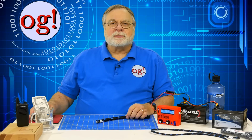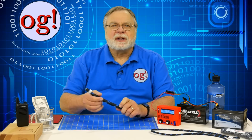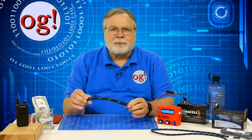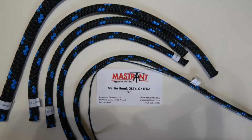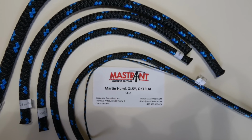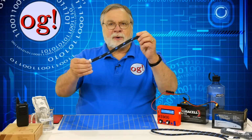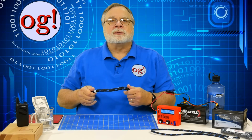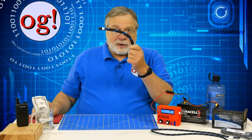It may seem hard to fathom, given the incredible loads on tower guy wires, that those can be replaced with less expensive but equally effective plastic guy rope. Mastrant is one such source, and I met them at Dayton. The array of guy ropes they manufacture is mind-boggling, from simple UV-resistant ropes for holding up your backyard dipole, or this monster P14 14-millimeter rope with breaking strength of 31 kilonewtons or over 7,000 pounds of breaking force. That's a strong rope.